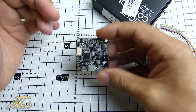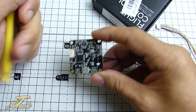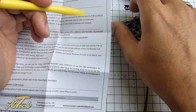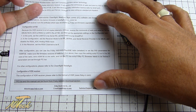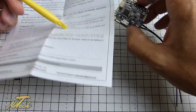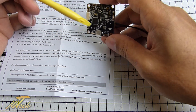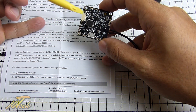Other things that are quite important: how would this be set up in terms of running with things like the SmartPort telemetry, and what UARTs are things on? It is actually pretty well documented in the manual that comes with it — and you can get this online as well. Go to the FrSky website and download the manual to cross-reference it. In the ports, select UART2 to be Serial RX, set UART3 to be SmartPort. It does come pre-flashed with Betaflight — I think this one came with 3.3.01. I've flashed Betaflight 3.1.6 on there and that has been absolutely fine. The target is the SPF3 EVO — very important you flash the correct target. And it also sends the RSSI down channel 8.